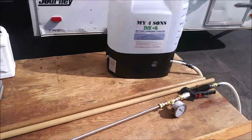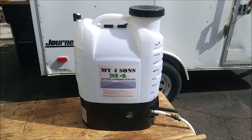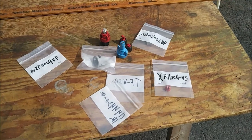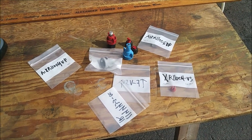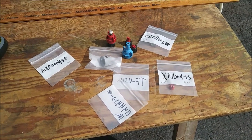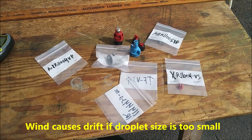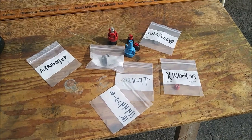You can't really rely on that rated flow — it all depends on the pressure coming out of your sprayer. There are lots of other nozzle types; it's really a personal preference trying to find one that matches your sprayer's needs and the droplet size you're looking for that won't drift too far away when you're applying it. So I'm going to try out the one I mentioned.